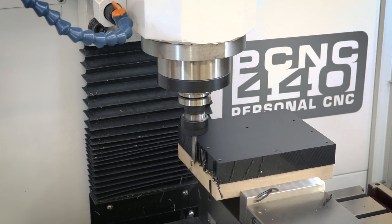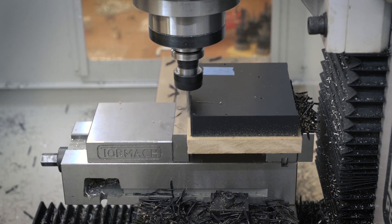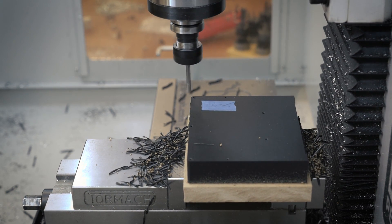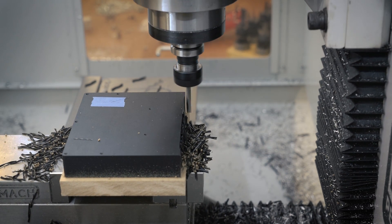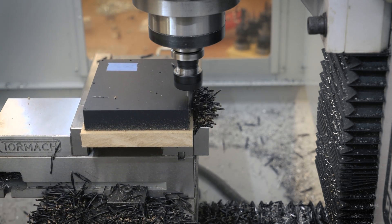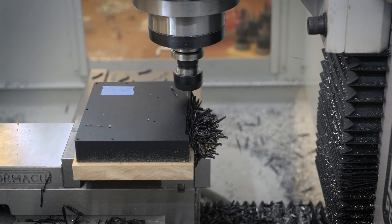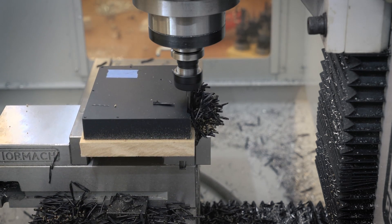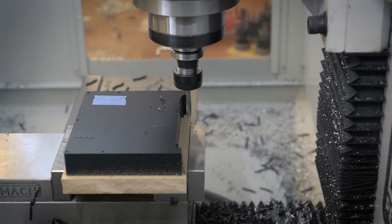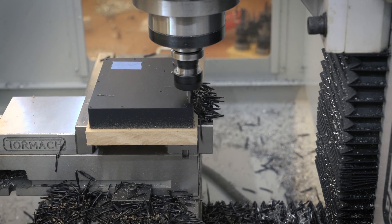UHMW is relatively easy and satisfying to cut. You just need a low RPM and a relatively high feed rate. I'm using a quarter-inch end mill specifically made for plastic — a single-flute end mill; there's a link in the description. In terms of feeds and speeds, I'm using 1500 RPM, anywhere between 40 and 50 inches per minute feed rate, a 0.1-inch step-over for all adaptive clearing passes, and generally a full depth of cut. When I cut the inner pocket I do two steps at about a half-inch depth of cut each — I'm a bit concerned about the ramping — but it is very satisfying to cut.